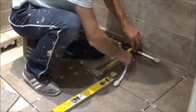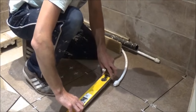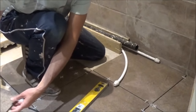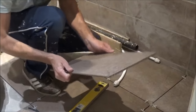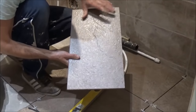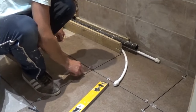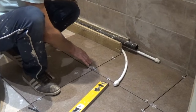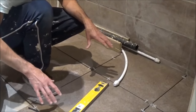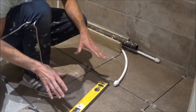Put your mark, draw a line with a straight edge, and always put a little squiggle on the sides you don't want — that's your waste. When you cut your tile, you can see my cut edge is tapered, so this end is wider than this end, and then when you put it in they'll fit in just like that. I've not put any tile cement down yet — I'm purely just laying these out to make sure that I get all my cuts in place before I put the tile cement down. It's only a small room so I'm going to do them all before I lay them.